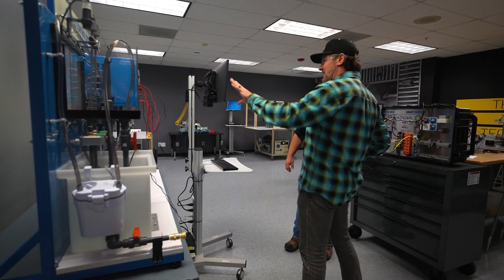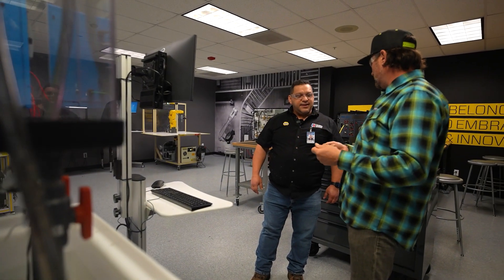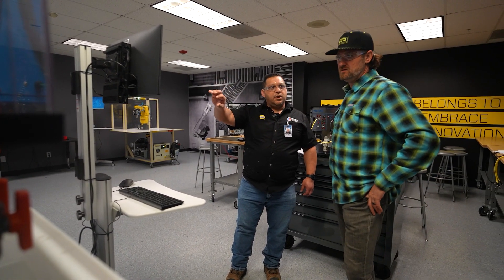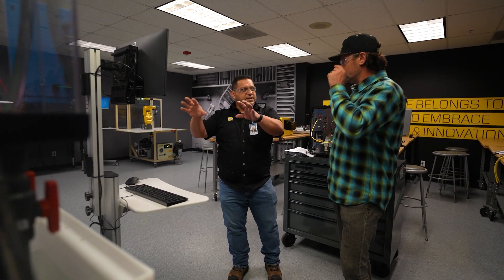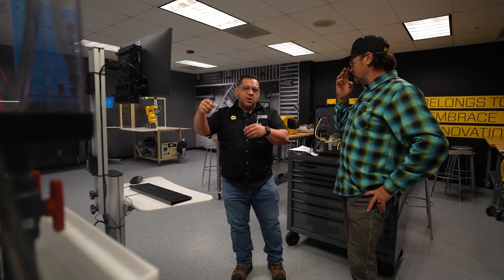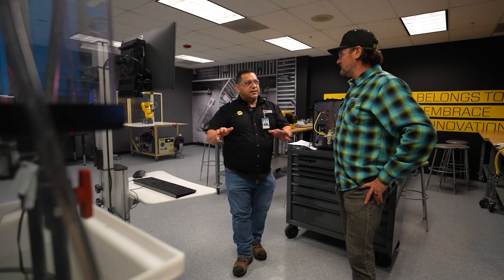You guys are creating tricks — breaking things for the students to figure out how to troubleshoot what part of the system has gone down. So they'll wire it up. Say you're giving them a relay, they know how to wire a relay, they know how to put the power supply. Once they have it working, we'll tell them to turn around and give them 40 ways of troubleshooting the issue — unplug the cable, unplug the relay, turn off an LED. It's their job to find that problem or error, without being guided, using the experience, knowledge, and skills we give them.